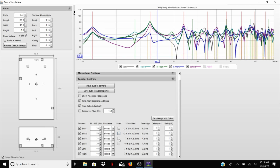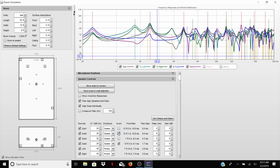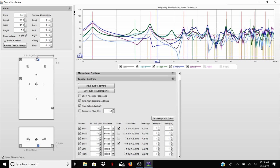So, for the most part, because of furniture and closets and you name it, rooms are not perfect cuboids. They do not have perfectly rigid walls. In fact, short of a steel bunker, they would never have rigid walls. And we know that the absorption is not flat. So walls themselves actually have a resonance frequency that they absorb at, and the Q and dampening of that resonant frequency depends on the wall's construction.